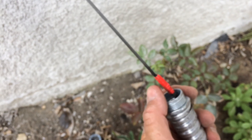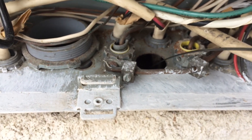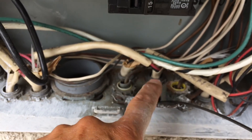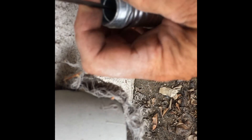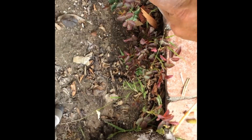I'm going to take off this red tape and hook the snake so I can pull it up through the snake. The snake is on a one-inch knockout, which is fortunate — it's a bigger knockout. I'll put a bushing in there to make it three-quarter when I'm finished. That's pretty much the last knockout I can use. There's ground wire in there blocking the path — it's going to be tight. I bent the fish tape so it's got a little prong that sticks underneath the coupling. You've got to put the coupling in and be able to pull pretty hard.